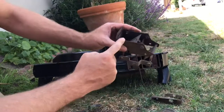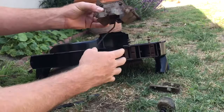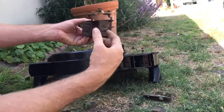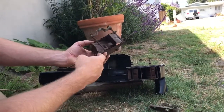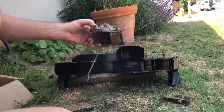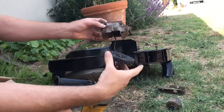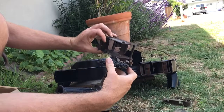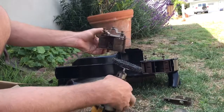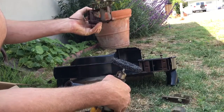There are two screws on each side of the shroud that hold it in place — one, two on each side — and then there's all this linkage to put it all together. I'm going to clean this one up. I got it used on eBay, and I'm going to scrape it down with one of these 3M scraping pads that are really wonderful and do the job very nicely. Then I'll prime them, paint them, and lube them up with a little grease for longevity's sake.